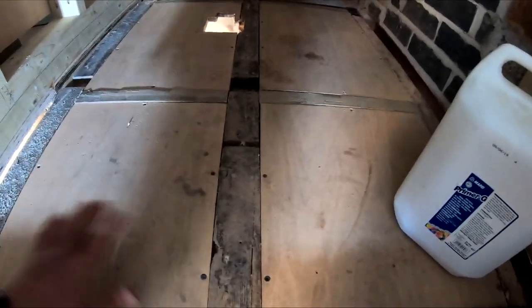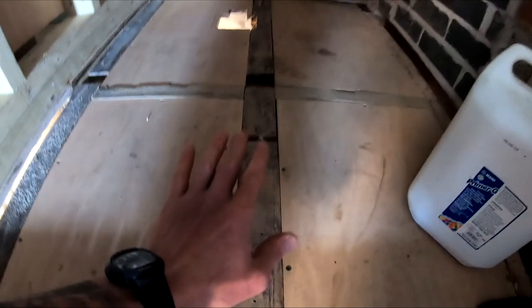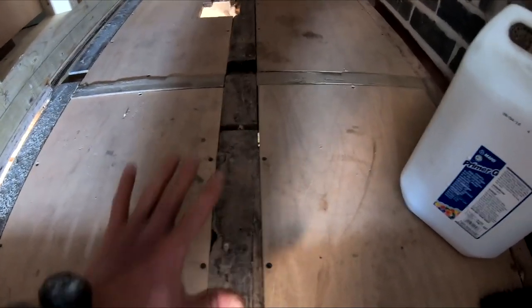So what we're doing is, because we've got old joists in here, we're gonna put some adhesive down and then the tray will be bed down on the adhesive. Okay, that way then we can make sure it's perfectly level and it comes through at the right height, allowing to make sure there's no difference in these two floor levels whatsoever.